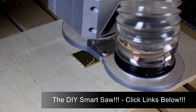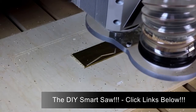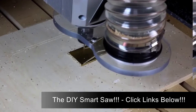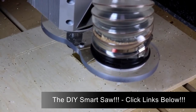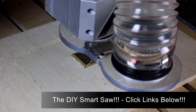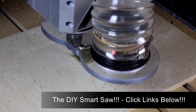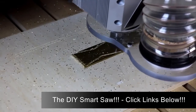The brass is being milled with a single flute eighth inch diameter cutter, making a bow tie that I'll put into a walnut table. Non-ferrous metals require a very light depth of cut, and notice here I'm finishing up with a climb cut in order to get the best possible surface finish on the brass.